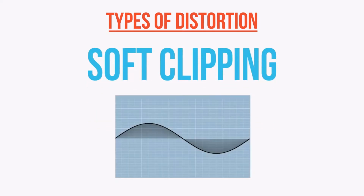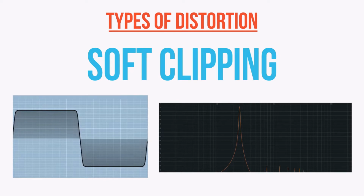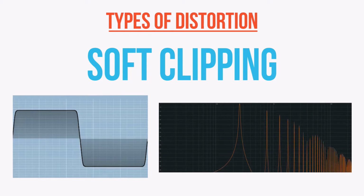For example, here we have a sine wave and we're going to put it through some soft clipping. You'll notice as we boost the amplitude of the sine wave and approach the threshold, the waveform gets squashed and somewhat resembles a square wave, but with rounded corners. This soft clipping of the sine wave creates a handful of harmonics above the fundamental frequency and makes the sound's timbre much brighter. You may have heard this type of distortion referred to as analog warmth or saturation. It is the most subtle form of distortion and is highly sought after and emulated in today's digital world.